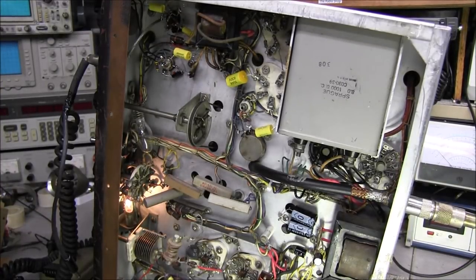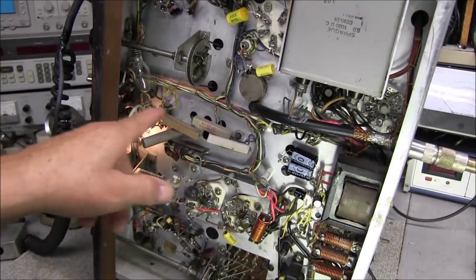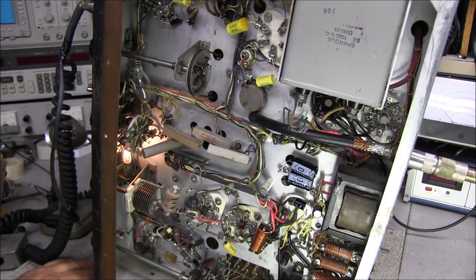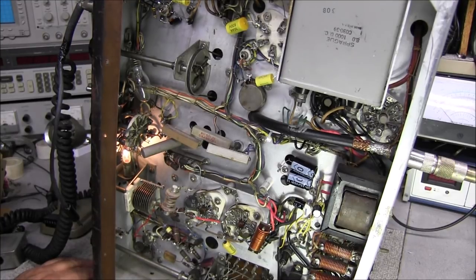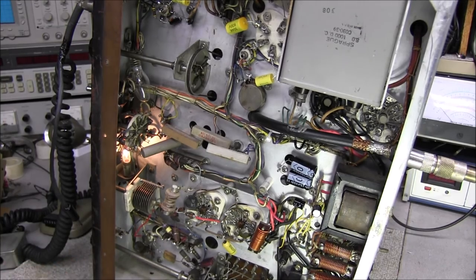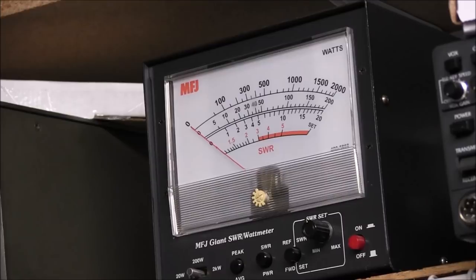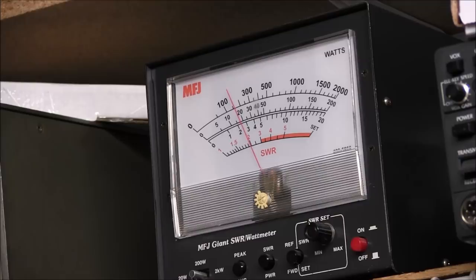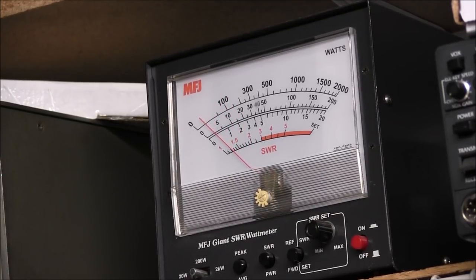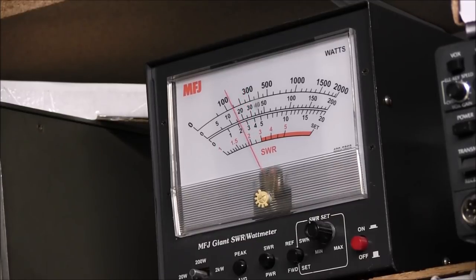In the next video, we'll get the meter working in those two positions. Then we'll get in here and redo this modulator current adjustment and put the correct resistors in, then a few more solder joints to tidy up, and I think we'll be making a home run with this one. It seems to be working pretty good. I'll switch back over to CW and key the transmitter — we can see about 120 watts on the meter, so that's pretty good. Switching over to phone, going to transmit: test 1, 2, 3. And we're pegging out the 200 scale, which is just the peak. That's not the most accurate way to check, but yeah, it is working.